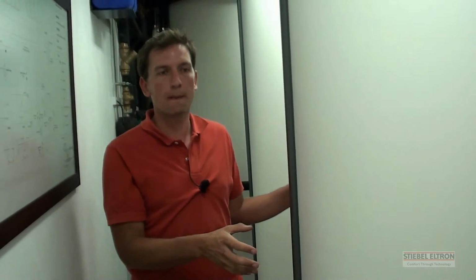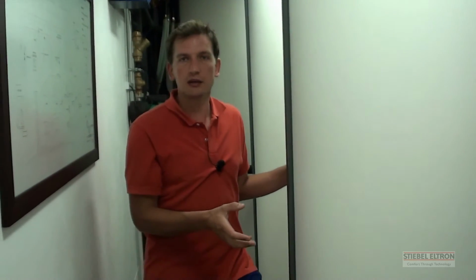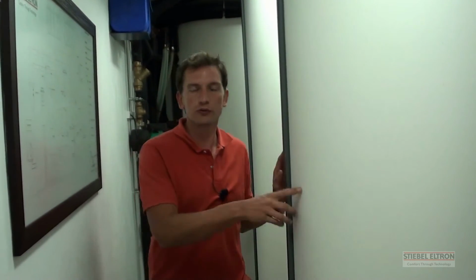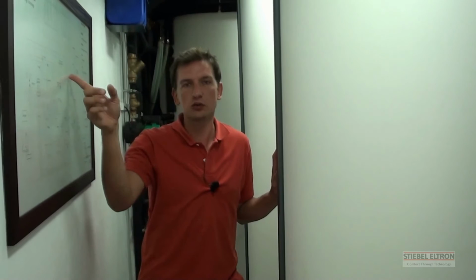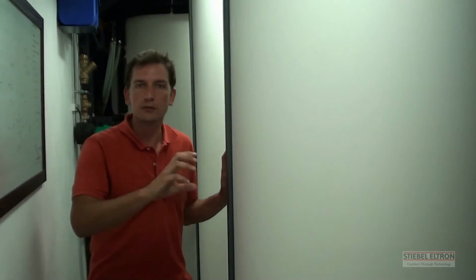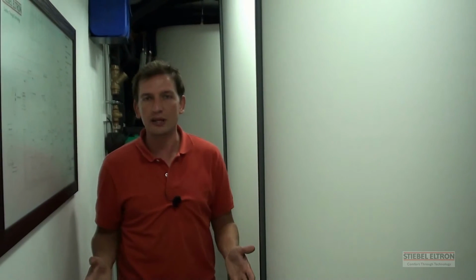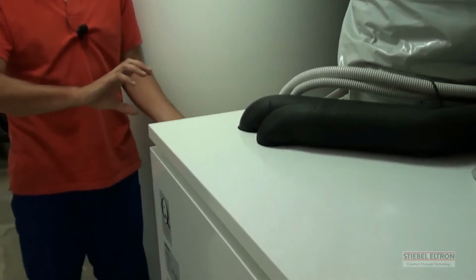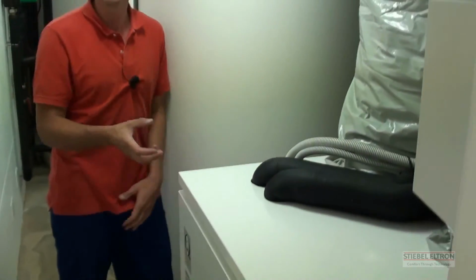This is just a straightforward cooling tank. It's for the summer season, because people have already got the infrastructure in the house to do heating, so we may as well transfer this via the convectors into cooling. When you switch the heat pump cycle over, we go from heat pump to cooling. That's exactly what a heat pump is. A heat pump is a fridge in reverse. So when we are not doing heating, the cycle inside the refrigeration system changes over and we do cooling.